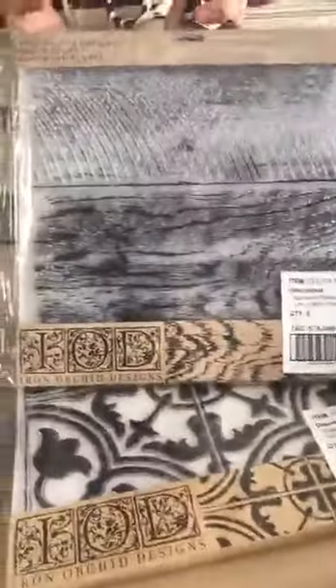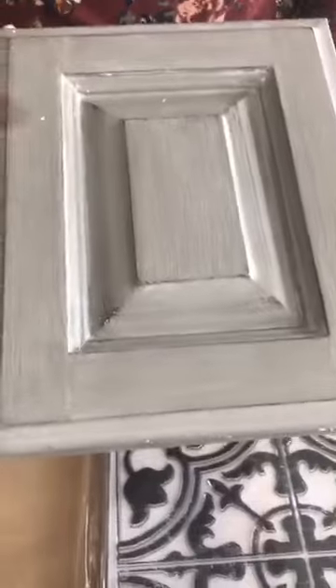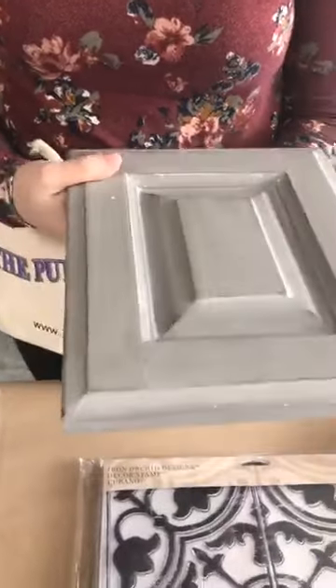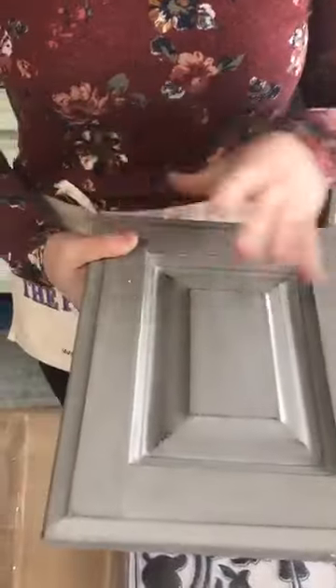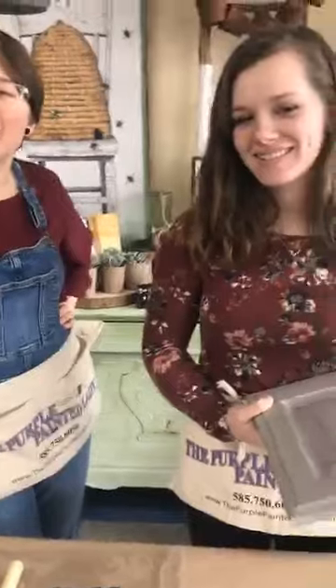What's really cool is making it look like wood in a non-traditional color. Going back to this mirror — with the Honfleur, French Linen, and old white wash technique — you could come back and do a weathered barnwood effect over it. A lot of people's main holdback from painting furniture is not wanting to lose the wood grain, so if you paint whatever color you want and then stamp the wood grain over it, that's a nice compromise. This is also brilliant for a lodge or cottage: you can get sheets of plywood, paint them, and actually make them look like strips of wood. That stamp is called Barnwood Planks.